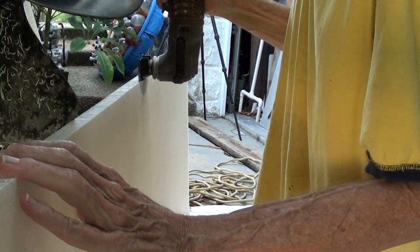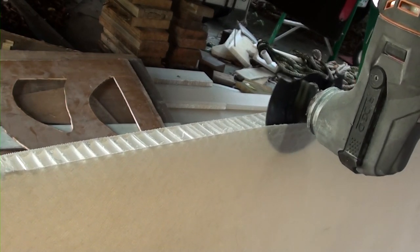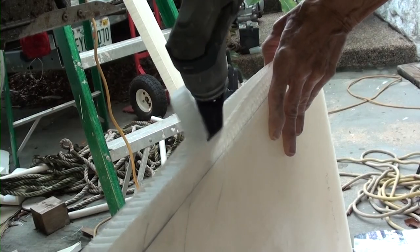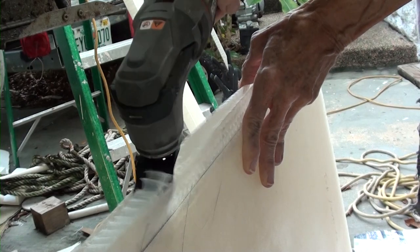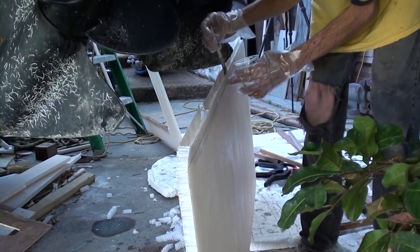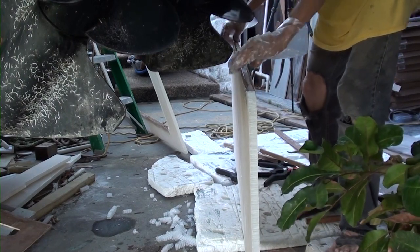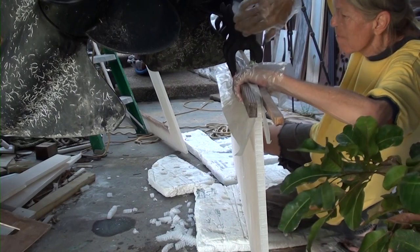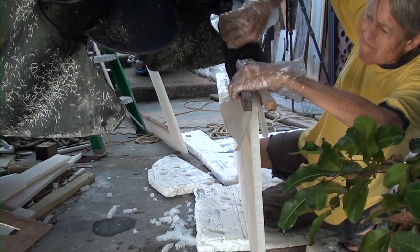And now that I've done that with the door frame, I have to go back and do the entire job all over again with the door, because I'm going to inlay that other strip of wood in the edge of the door for the other side of the hinge to screw to. And this isn't getting redundant at all, meaning the resin inside the slot and inlaying the wood, the wax paper, the clamp, and do you think we're done with the inlays yet? I wouldn't bet on it.